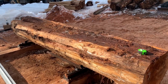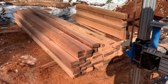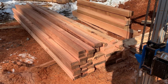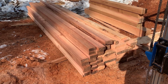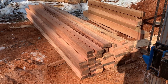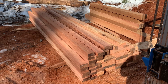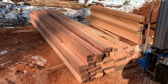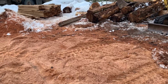Got that other one milled up, got cleaned up, took a little lunch break. I don't remember the exact counts, so I'll put the counts in the description. But I got about 220 board feet out of it. Now on that Doyle scale that I'm using, the app said that log should have been around 243 board feet. You've got to factor in some waste, 10% or so, so I guess the math checks out. I didn't anticipate being that close to it. I figured I'd have a little bit more waste, but I'm not complaining.